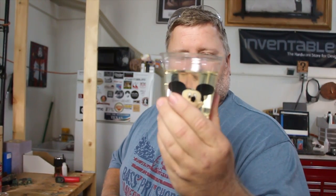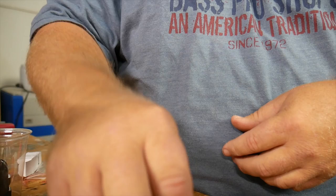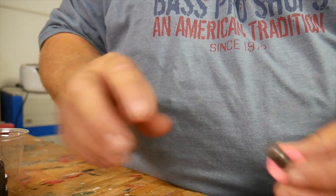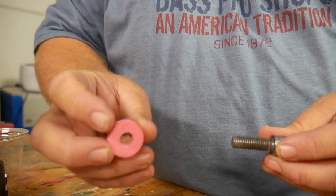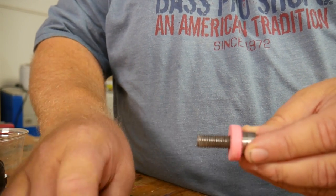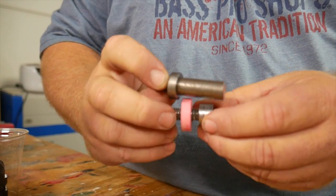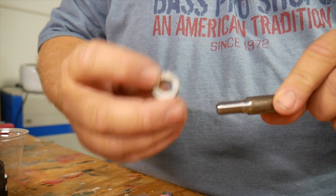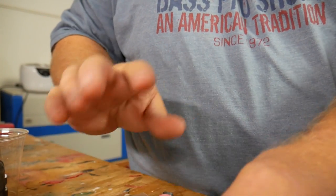I'm gonna make a bottle stopper using this block that I made. It's a stand-up type — a cool little bottle stopper that's short, so when you have your turned project you can stand them up and they look cool. For years I've always used a bolt with the same threads as the bottle stopper as my mandrel, cut out of a piece of acrylic scrap. Now on Turners we just added these actual mandrels, which are much nicer — a lot more to hold onto than the old bolt method. They're interchangeable sizes: one inch, three-quarter, and five-eighths for all the different sizes, so now I've got one that'll line up to the bottle stopper.